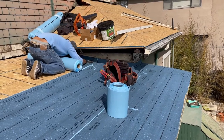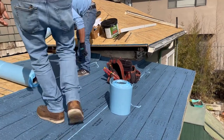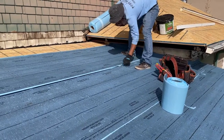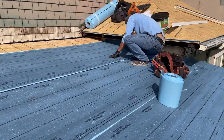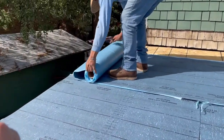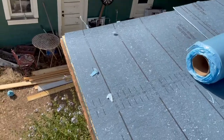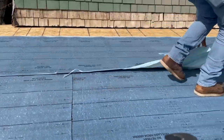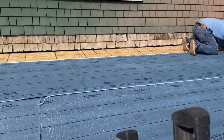Before you roll these out, you want to make sure you align them properly. Start at the end, roll it out, and make sure that edge is nice and even. Because these things are so sticky that once you remove that film and release the adhesive backer, you're going to have a really difficult time realigning it — it's almost impossible. So you want to cut it to size, align it, hold it in place before you start adhering. All you have to do is pull that release film strip from the bottom while it's already in place.